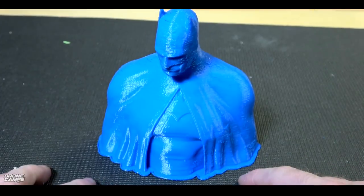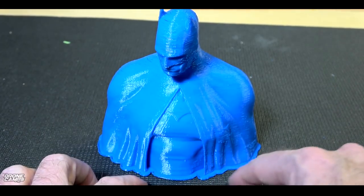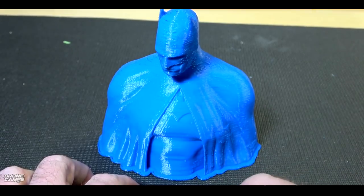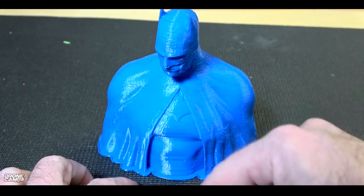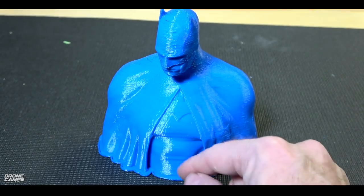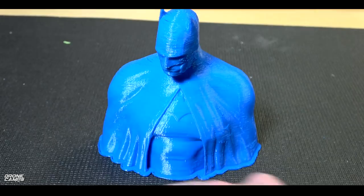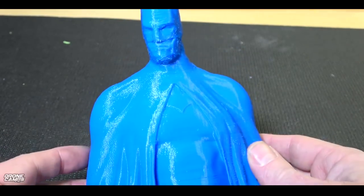Because what the skirt does on the bottom of your print — it actually gets the nozzle ready to start having the filament flow through for you. So by the time it reaches the raft, it's good to go. And you're not going to have any holes in your raft usually if you do a brim. Usually I do two passes on the brim, and that's pretty much ready to go for my print.